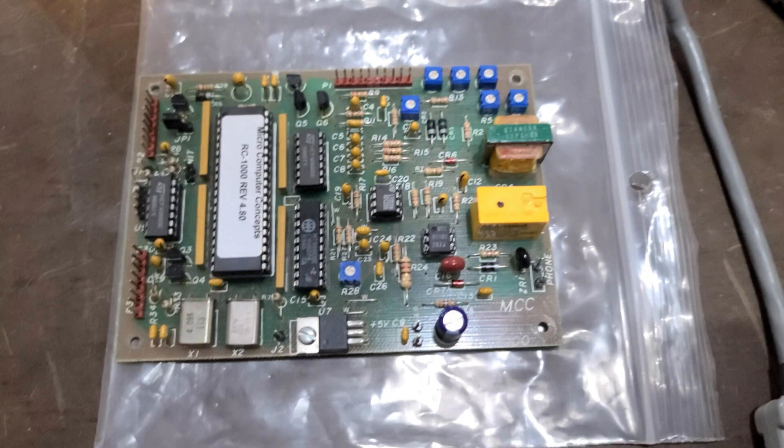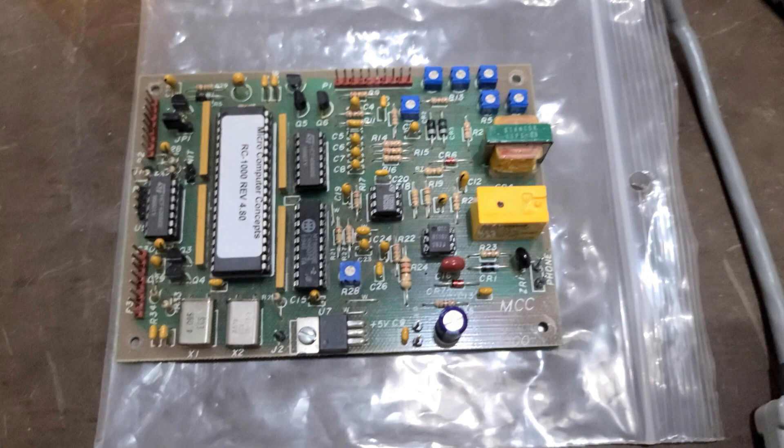The MCC microcontroller for working with these two radios is one of the more expensive items in the build — these run about $200. You can still find them used or as new old stock, but they're not cheap. You're also going to need a duplexer. If you buy a commercial repeater, you can get the duplexer built in, and you'll have to tune it for VHF, UHF, or GMRS in our case. Duplexers tend to run about $400 — again, not inexpensive. Maybe you can find one used and still in good shape.